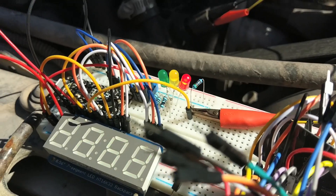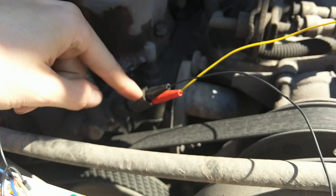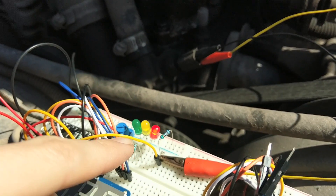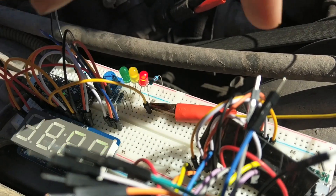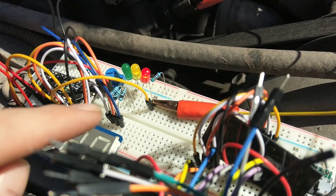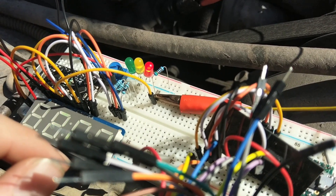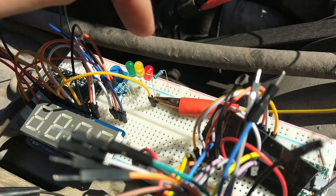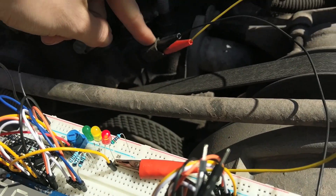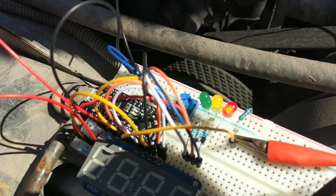The way this whole system works - all we're doing is making a voltage divider. We're taking this resistance and this resistance and reading the middle of it. We have two resistors connected to each other, and by reading the center, we get a division of the two. We have five volts on one end, ground on the other, and in the middle is a reading that fluctuates because of how the sensor resistance changes - kind of like how a potentiometer works.